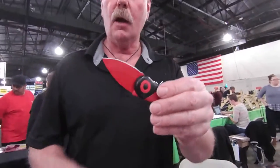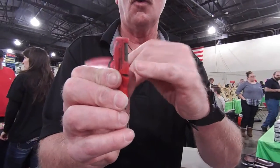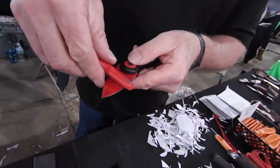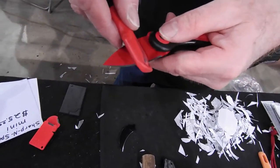We're gonna take the outside radius and just slide it right down the radius. There's a sharp corner there, sharp corner there. Touch it to the knife like this. Match the bevel, the angle, the degree on there — about 12 to 14 degrees.